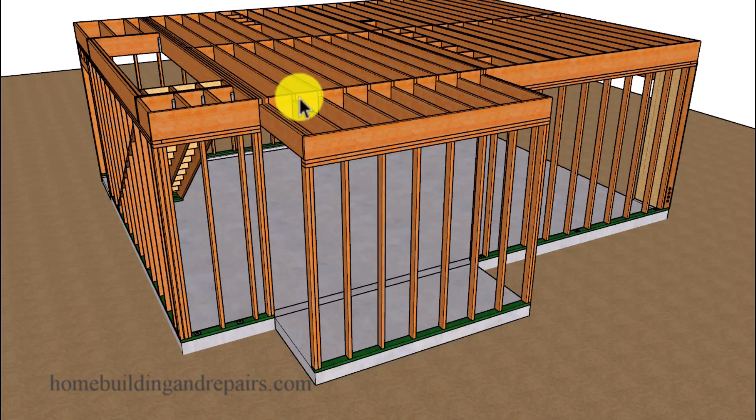However, if you do not have a notched joist and the board is a 2x12, but you've added 4 feet to your 20-foot span — giving you a 24-foot floor span — then those are the new numbers you would use on a floor framing span chart to see if you could remove this wall and move it over.